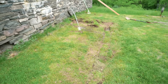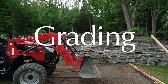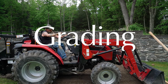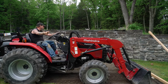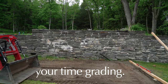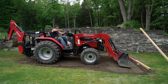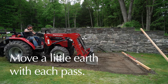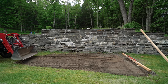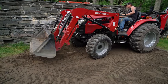All right, looks like we have a decent amount of pressure coming out of our pipe. Now we're going to prepare the site. What that will do is compact down and create a hard surface for our tub to sit on. You could use 3/4 gravel, you can use anything that's going to shed water. This is what we had available, and that's what we're going to use. And if it creates a hard pan right there, the water will run off of it versus leach into it.